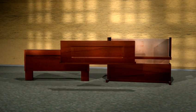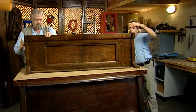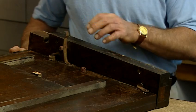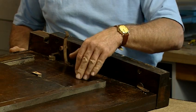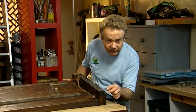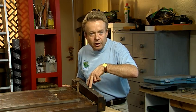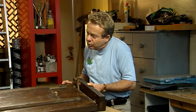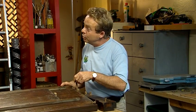The lower front panel is exactly the right size for the foot of the bed — it looks perfect. We'll need to cut some jarrah to go in here to brace between the side legs or pillars and the top. We'll also need to cut a bit of infill down here because this is where the base gets bolted to the side pillars and it needs to be nice and strong. We'll remove all the old fittings, find the jarrah, cut it and glue it on.